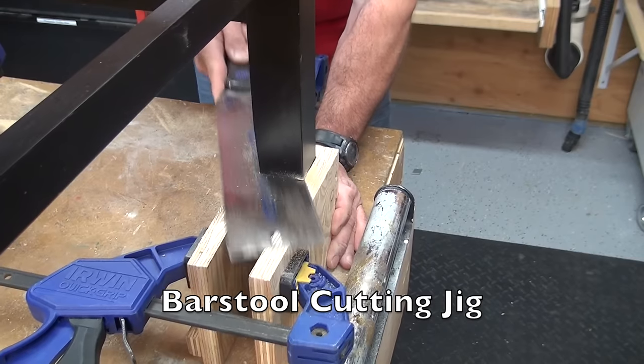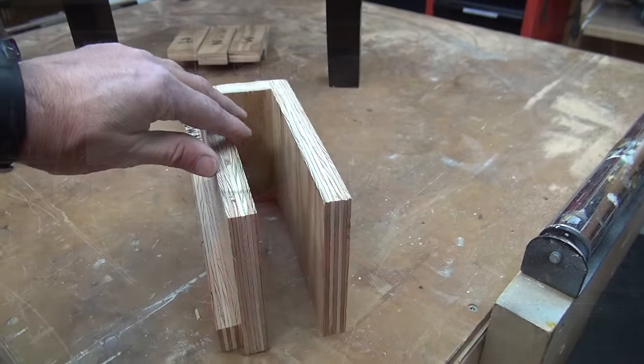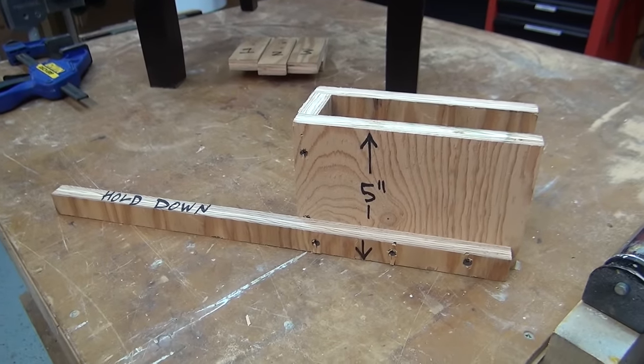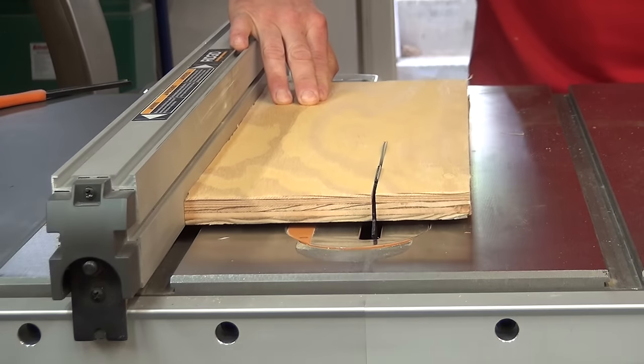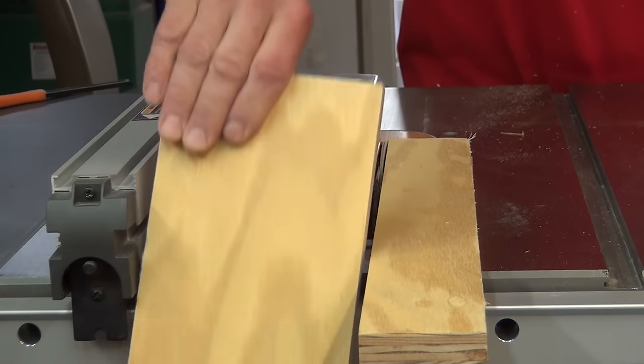Jigs help keep us honest and ensure that all four legs are cut at the exact same height with no wobble. There's no going back to fix this a second time — you've got to get it right. Making a cutting jig is really the most important thing you can do for this procedure. I use scrap AC plywood, ripped to a specific height — mine was five inches, because I wanted to lower my bar stool five inches.